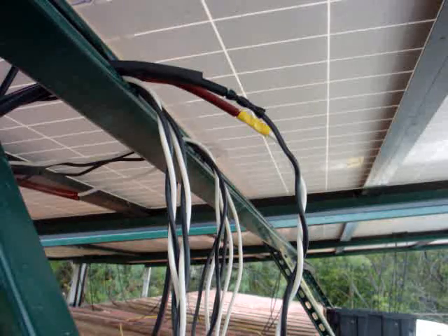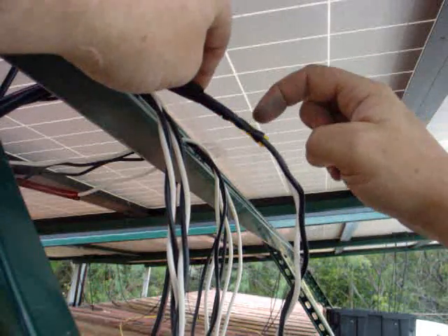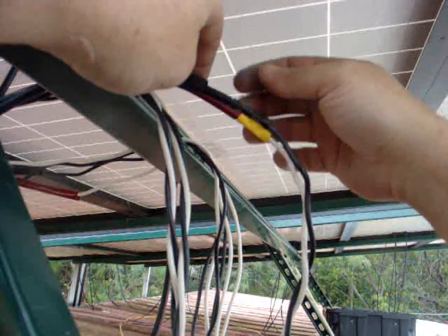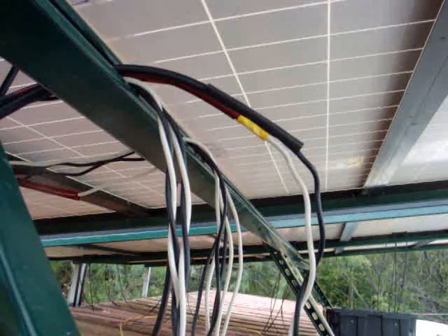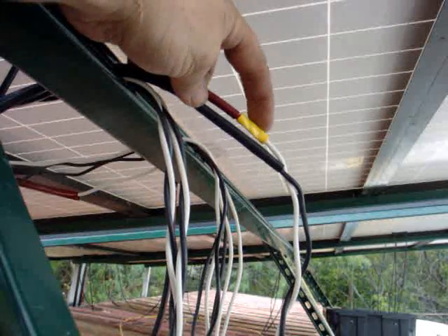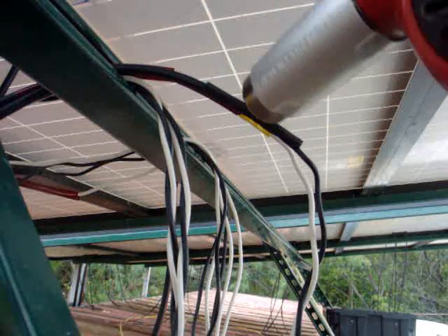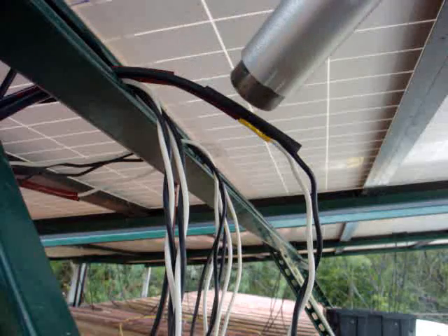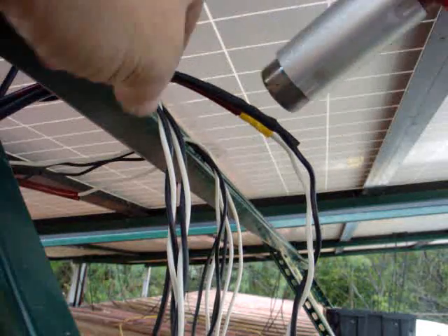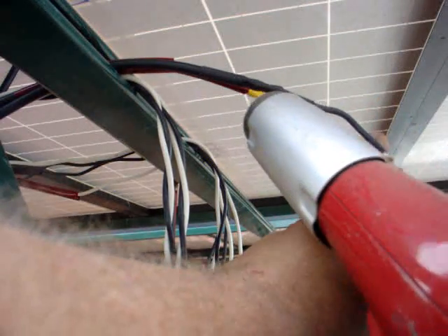I must not have been paying attention. If I make a mistake I want to tell you so you know not to do the same thing — I crimped too far up on this one and the wire came out on the yank test, so I just redid it. That's why it's not painted red. Anyway, this is my heat shrink. Notice how it's lined up: one inch here, one inch here, one inch here. Move the heat gun — always keep it moving. You'll see it start to shrink, and that's when it's time to go to the other side.